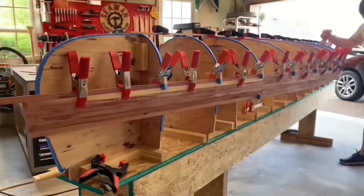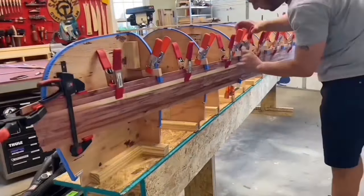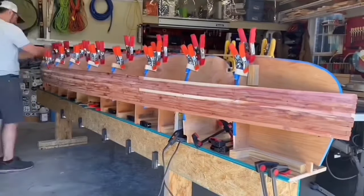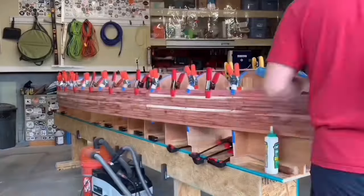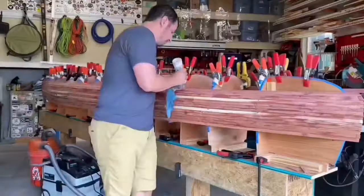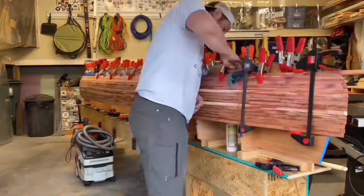The process continues with adding each strip, gluing in place, and clamping them tight. I chose to limit the staple holes by clamping with L-shaped supports. If you have watched other canoe builds, you will notice I did not go with the laminated stems. I chose instead to weave the end of each row, mostly for aesthetics.